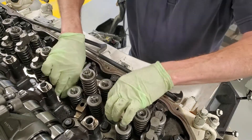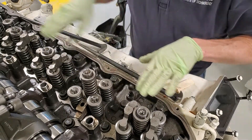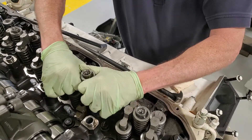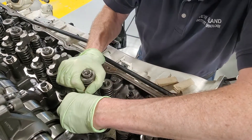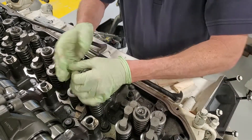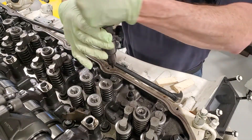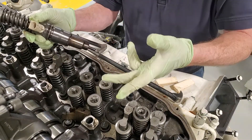Got it loose. Now, if I had not drained down the fuel rail in the cylinder head, right about now I'd hear gurgle gurgle gurgle — that would be fuel pouring down that bore. Let's just work on that — come on, that one doesn't want to come out — there it is. Perfect. Valve bridge is out, here's your unit injector. Pretty expensive little units.